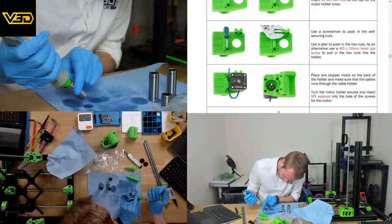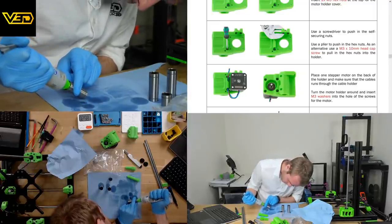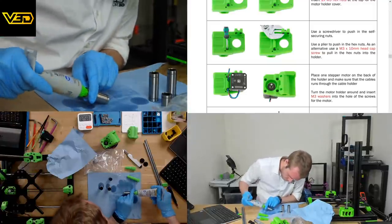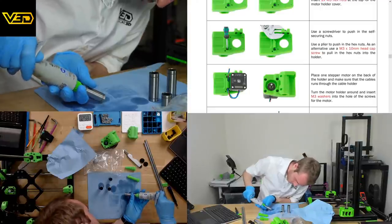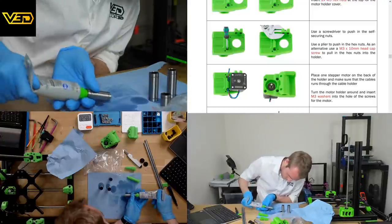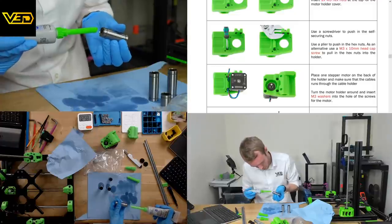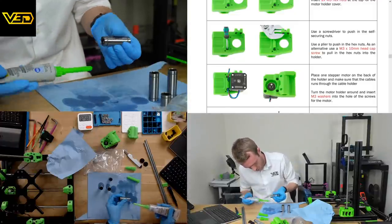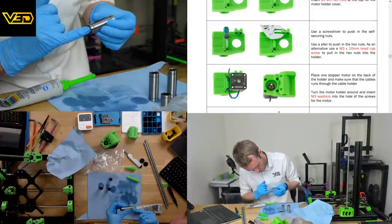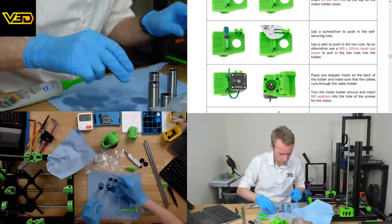Some are designed to be really thin, coating really lightly. They get washed away more easily and don't stick around for as long, but they're also less prone to picking up dirt. Or you have thicker lubes like this one, which stick around for a whole lot longer. Slightly more viscous, could pick up more dirt, but obviously they're inside a sealed bearing, so not a problem in this case.